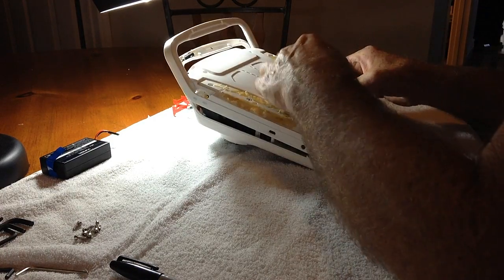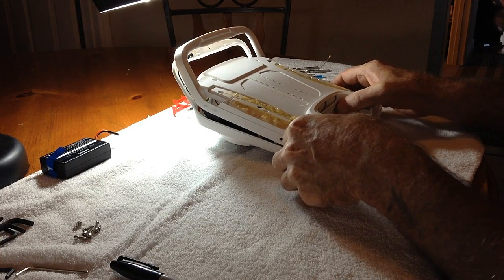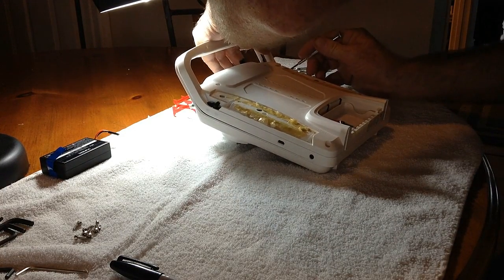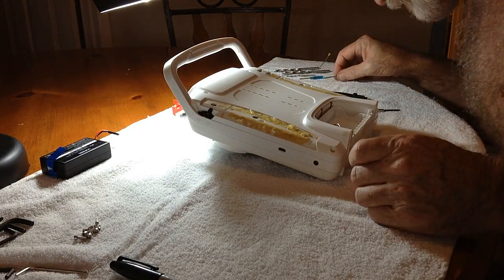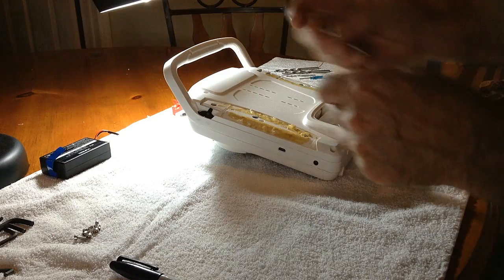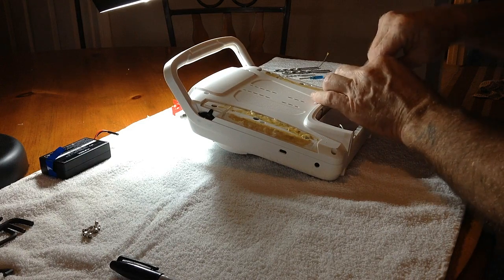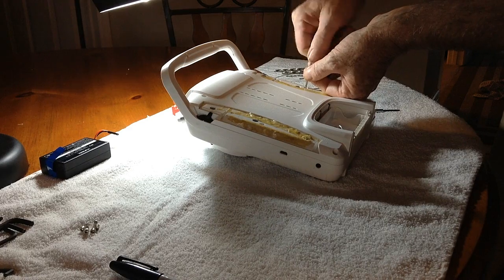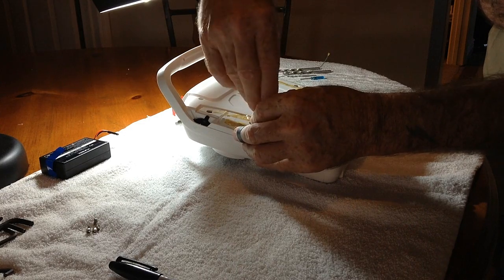As I close this back, if you look on the bottom left of the transmitter, there is a speaker — this little red speaker. It's got a little semicircle recession that it should fit in, so make sure that's seated before you put the lid on. Adjust your camera and speed ratio levers to the center position and that clamshell back will slide right down on it. Now we're going to button it up — it's basically a reverse of what we did in the beginning. We'll hit these four corner Allen screws, make sure we get those two up in the top handle area, and then the two that are beneath the hand grips. Tighten them down finger tight, enough that they're not going to fall out, but not so much that you risk stripping plastic or cracking anything.